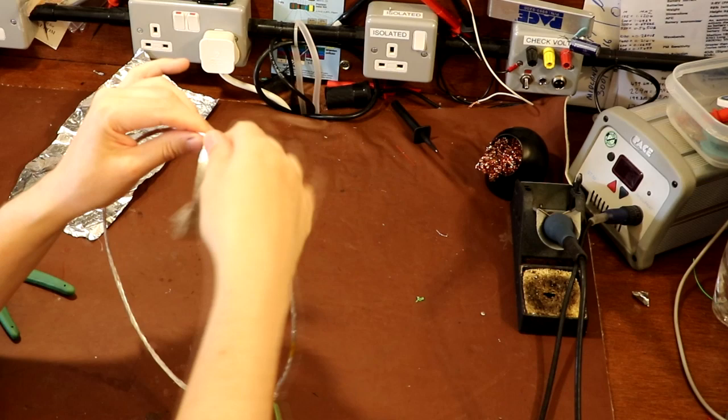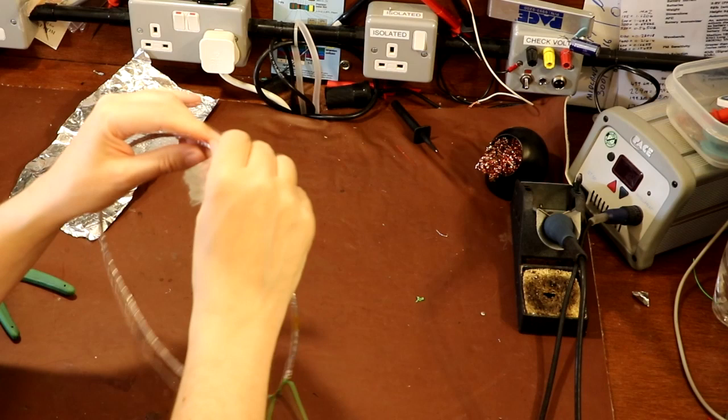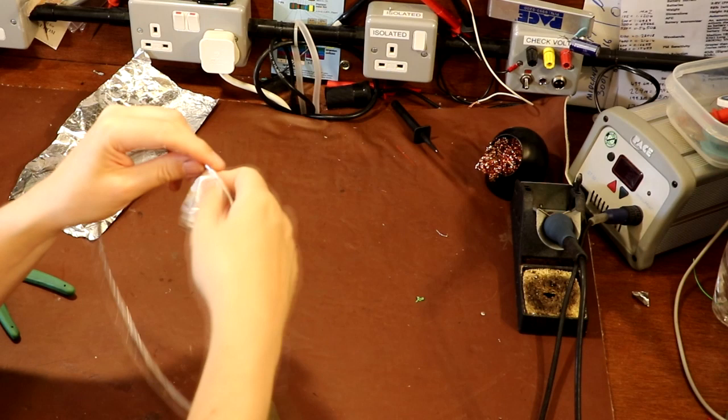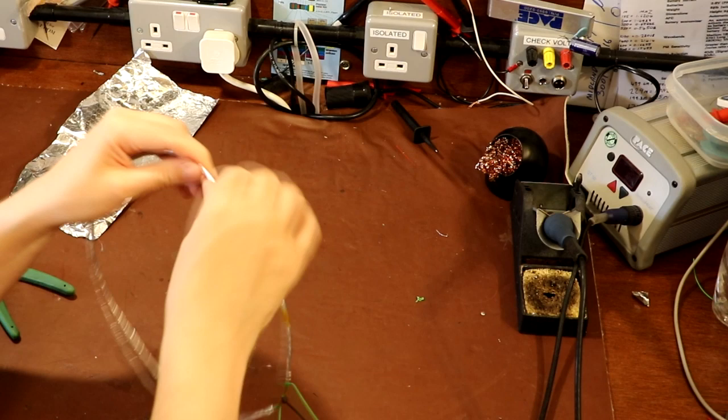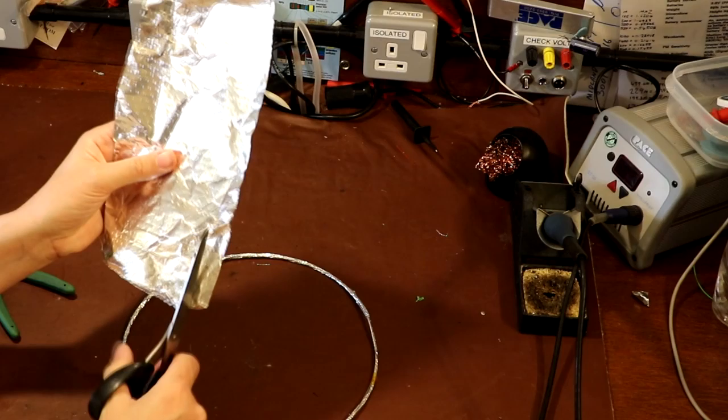Now, unfortunately, they're not commonly used because they tend to have very, very narrow bandwidths in operation, so they're not necessarily the most practical thing to have set up in the home environment. Radio amateurs will experiment with magnetic loops, but I'm afraid they have very narrow bandwidths and require a bit of tuning and fettling. So that's why you don't see magnetic loop antennas in very common use.